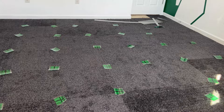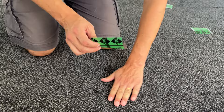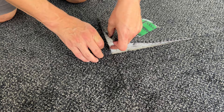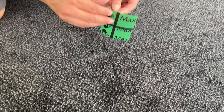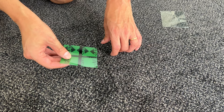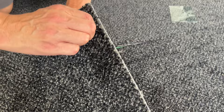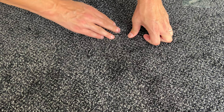On to the final stage. Your carpet tile kit will likely come with self-adhesive tabs. This is called a floating floor system — there is nothing attaching it to the subfloor, which makes installation incredibly simple. These tabs go where your four corners come together. The self-adhesive tabs will keep the carpet stuck down so they don't ever lift up. You separate the tab — there are hash marks, the black lines — and you stick a corner of the carpet tile to each one. There we go — it's stuck down, all four corners are stuck together. That seam should not lift up; they should all be stuck together.